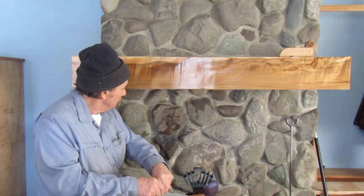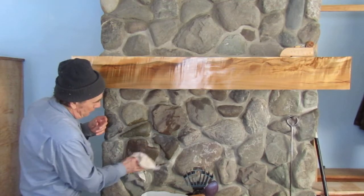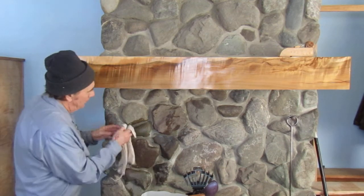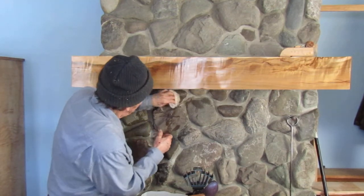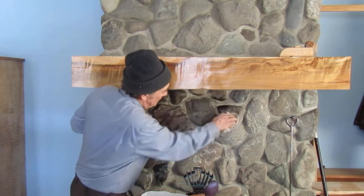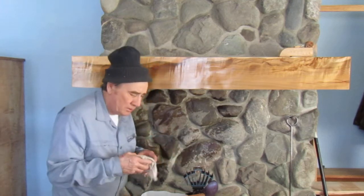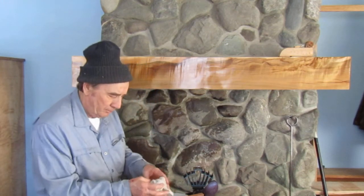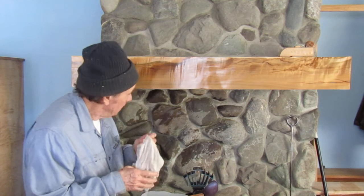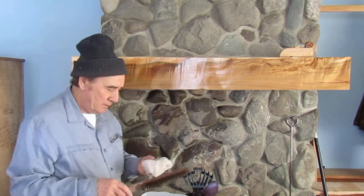This here is real stone, so you can go at it with a wire brush or do whatever you want. The trick to installing it is just to keep it clean as you go. If you're going to have an accident and get a lot of mortar on it, just take the stone off, wash it, and put it back on. A little bit of mortar on the stone is okay — some people actually want a little bit on it to prove it's real stone, because there are so many look-alikes out there today. I hope this was a help to you — see you in the next video.